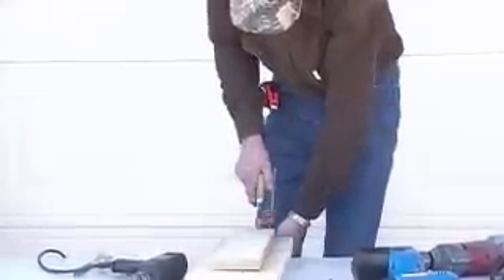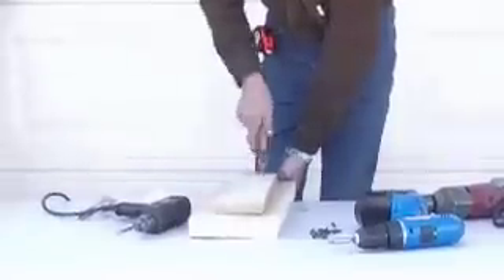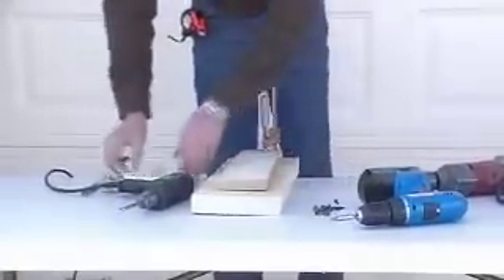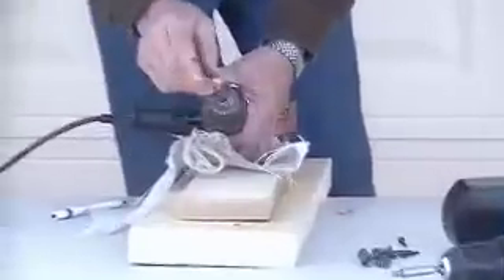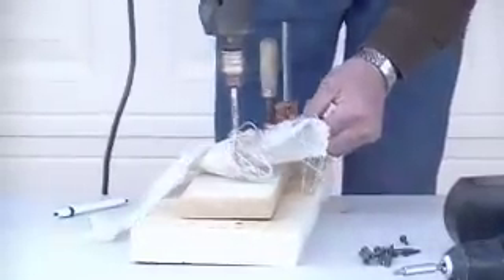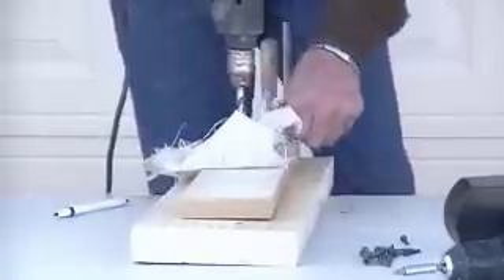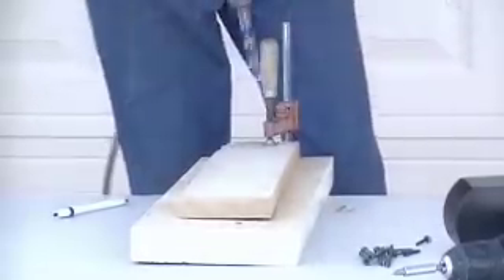Now here's another safety thing I want to talk to you about — hanging up fabrics, drilling through carpet, upholstery materials, into chairs, curtains and drapes. Because of the way a drill bit is made, it will snag on fabric. I'm going to put it down here and let you see what it'll do. If your hand is wrapped up in it or that's your shirt, you're hurt — hurt real bad. It's a very dangerous thing, so you never want to get fabric involved.